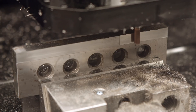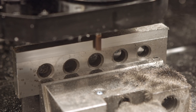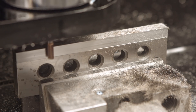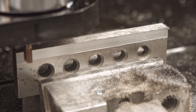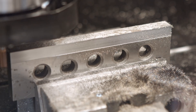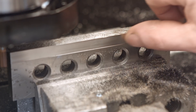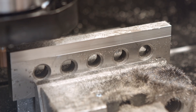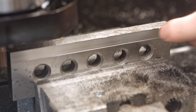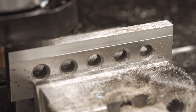It's making some very thin chips and now it's gonna be making bigger chips. The spindle didn't observe any change from idle. How does it look? I think there is tool deflection because it's so tiny, but when it went over the hump, you can see something. Yeah, the finish looks exactly the same — no difference whatsoever. So I guess I would go deeper.